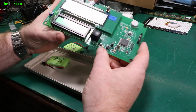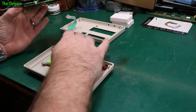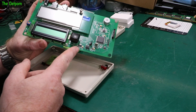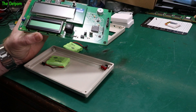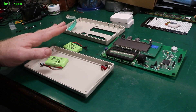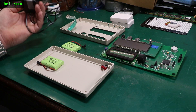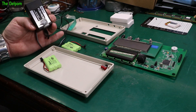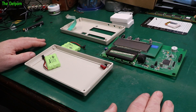This regulator can do like 30 volts max input, so running a high voltage in to charge the batteries is not an issue at all. The battery dropout voltage would be around 800 millivolts — that's the last you want to go on them. This is a low dropout regulator so it can actually go down to like 5.4 volts for the size of dropout — that is absolutely perfect. So these batteries drop out basically when the battery is completely flat, which is when the regulator also stops working — they align quite well voltage-wise. Fully charged these would be like 9 volts, which means if you use a 9-volt power supply — the supply which came with it currently set to 6 volts, but it's got a 9-volt setting — you don't even need a new power adapter. So 9-volt input will charge the batteries, the regulator can handle 9 volts, no problem. And it's relatively straightforward, so let's get on with it.